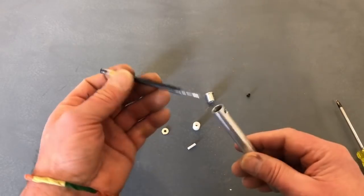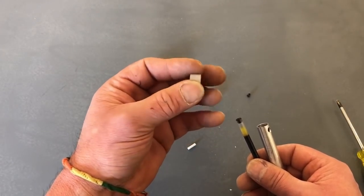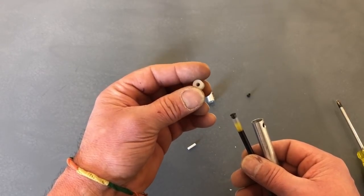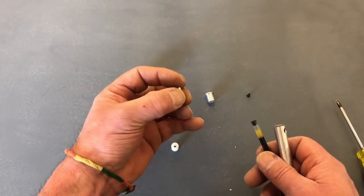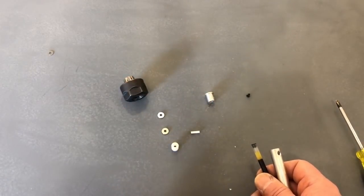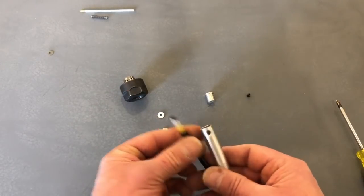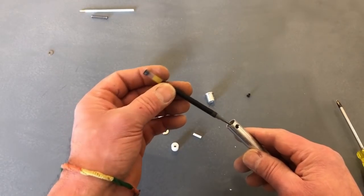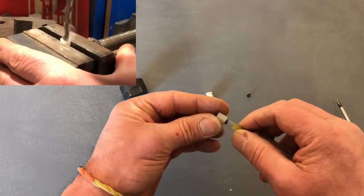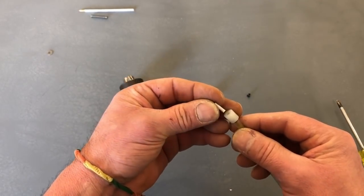How does this assemble? You've got to make this little nylon spacer — you can get these at Home Depot or Lowe's. This is a 3/8 OD spacer with about a 1/8-inch hole in it. I just cut a little piece of plastic off the end of one of these pens as a guide for the magnets. This little spacer has a counterbored hole to make a seat so that it stays centered, and a clearance hole for the little plastic pen part.